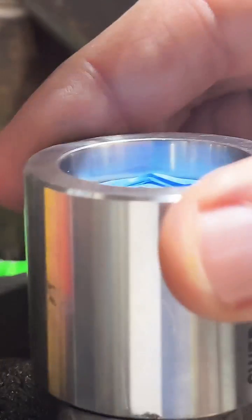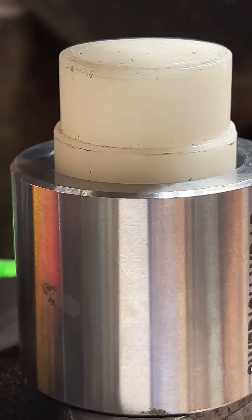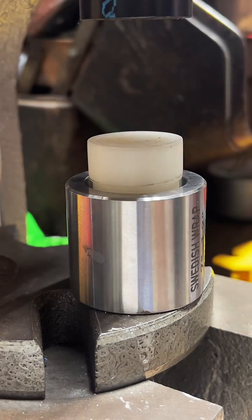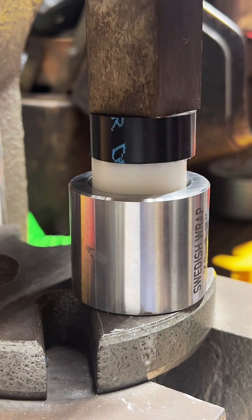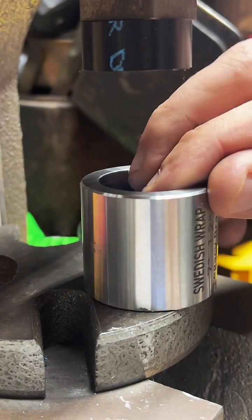Gold is a lot softer to work with, right? I think fine silver, that's what I'm working on right here, is actually softer than gold. There's a couple different carats of gold, 14 karat, 24 karat, so different alloys have different strengths. It really depends on what the coin's made out of. Gold is softer than copper, and definitely softer than 90% silver. But fine silver is actually softer than gold, at least in my experience, that's the way it feels when I work on it.